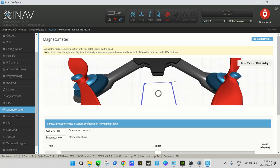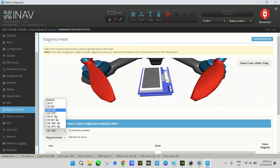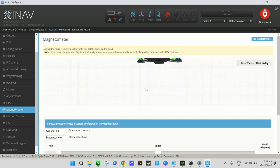The diagram shows the connector on the forward end, but on our drone it's at the back end — so we need to change the compass orientation. Try 90 degrees — no, it's on the other side. Try 180 — also not right. We need to flip it to 90 degrees in the correct direction.